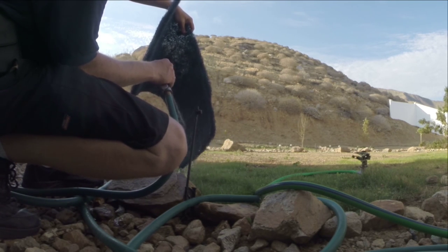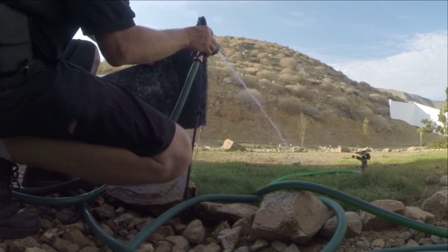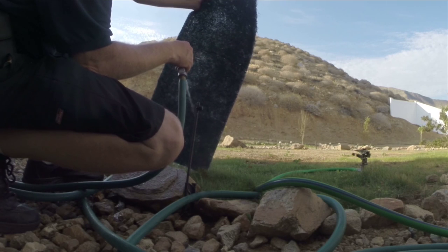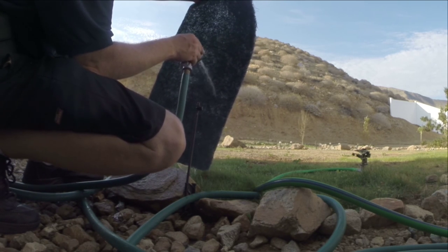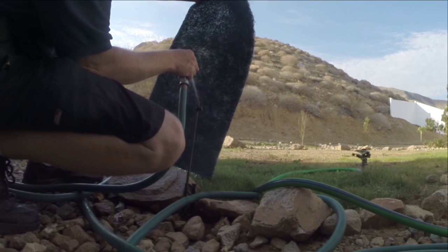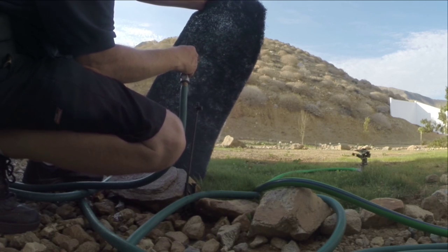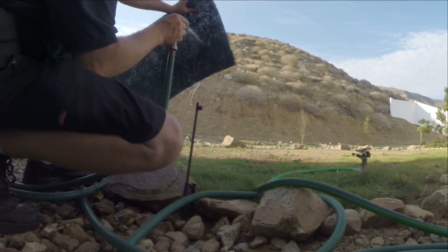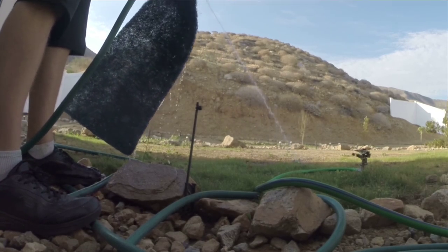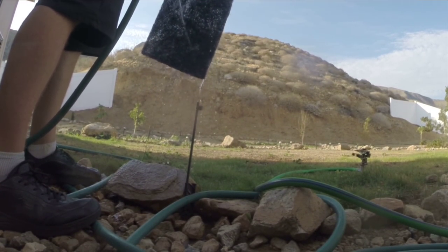Now I'll just finish it off, knocking it off from the sides. These are a very effective filter — they're filtering at a good efficiency rate right away. Some of the economy filters are nice, but you're not really getting good filtration right away. It takes about 30 to 60 days before you're getting smaller micron filtration because the hole between fibers is so large, whereas this is a much denser material filtering out a fairly large amount right away. It's just an effective filter media, and it's reusable.